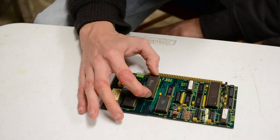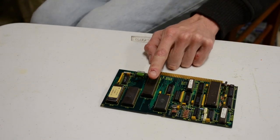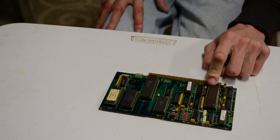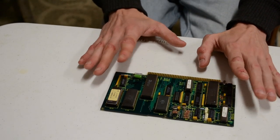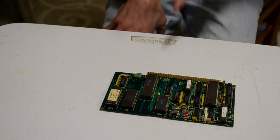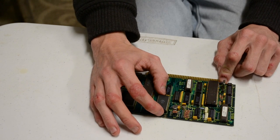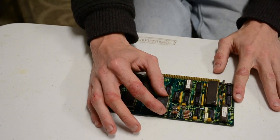This is a programmable peripheral interface. I'm tipping it will take in the 12-bit words to deal with, because this is an Intel microcontroller and it's an 8-bit microcontroller, so no 12 bits, 8 bits. At a guess, this does some 12-bit to 8-bit peripheral work, or it talks to the tape drive, or both. This is an Atmel EEPROM, 2 kilobytes.